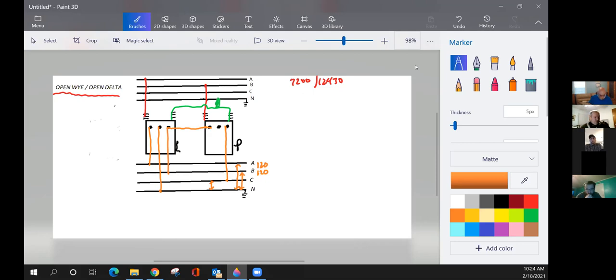240. What did we say before? What was it on the closed up thing? Yeah, what's on the top, I got 120. You're combining two different primary phases. You're getting output from the left transformer and the right transformer. Should be 208. Hey, congratulations.